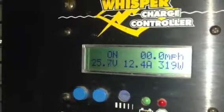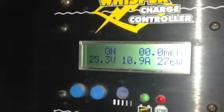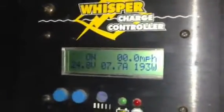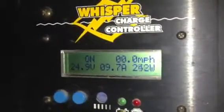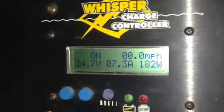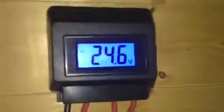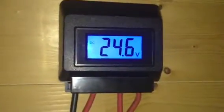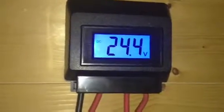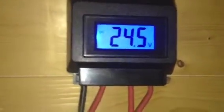When it dumps, it's going to a small water tank with a 600 watt 24 volt immersion heater. As it dumps for a few seconds at a time, we've added another little charge controller here which is available on eBay — it's a wind turbine controller and a charge controller for solar as well.